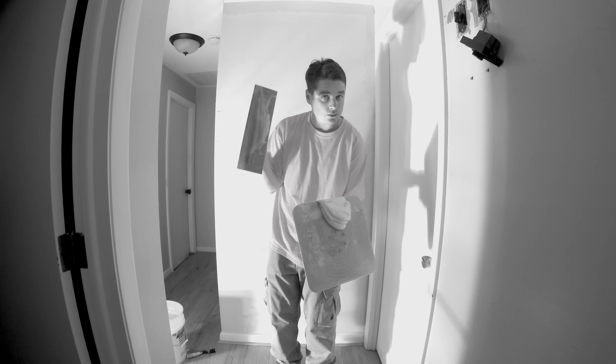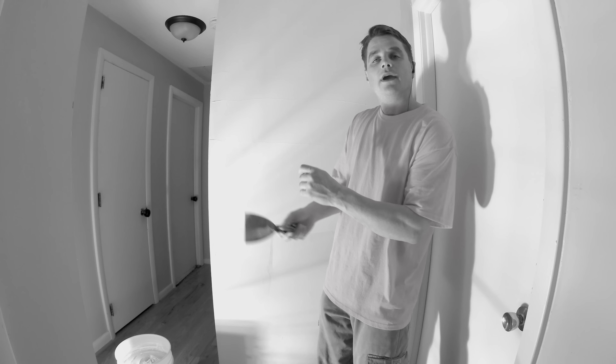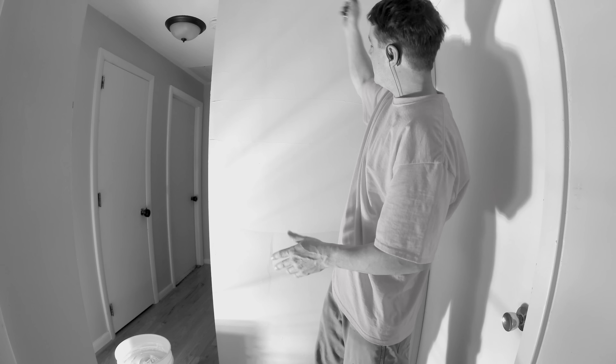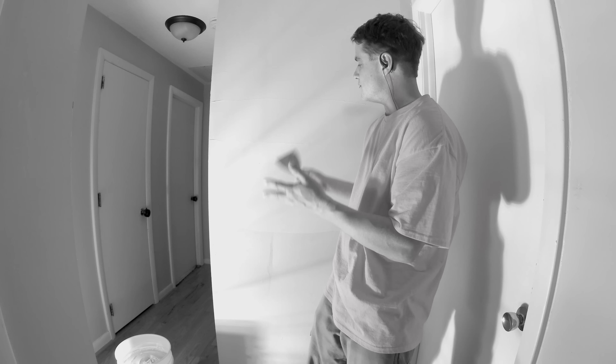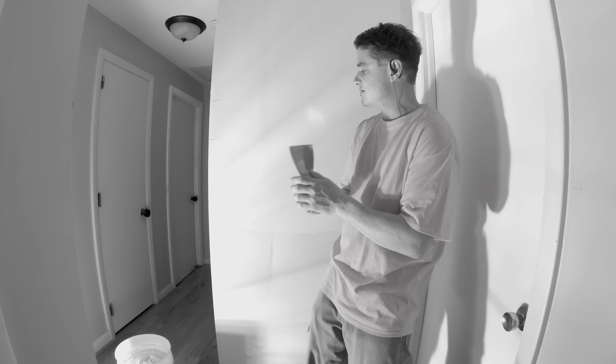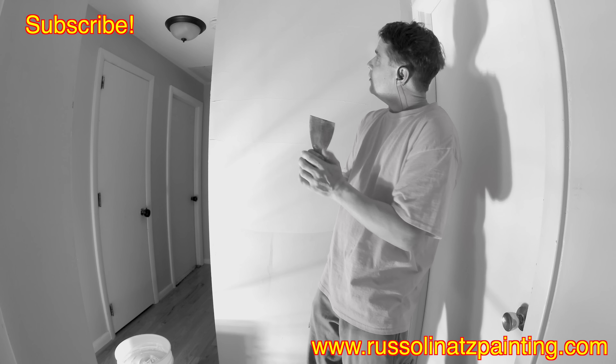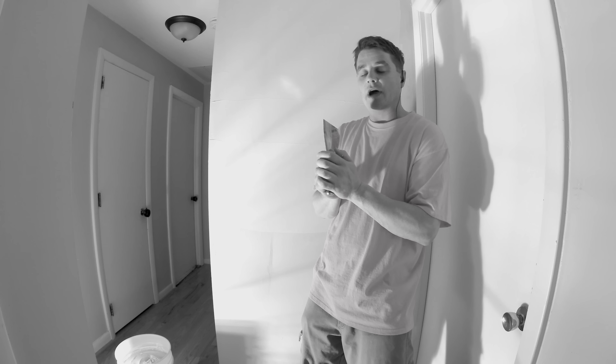So I'll clean this off and put these tools down. Move the camera a bit closer so you can see it. That's your first coat. Give this a few hours to dry out. If you have one of those air movers, it can blow air around and it's great for jobs like this — it'll make the joint compound dry a lot faster. This is going to dry as the water escapes into the air, and then it dries out, so it will shrink. We'll be back in a few hours to see the progress.